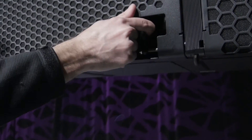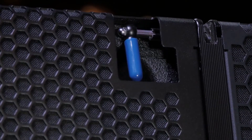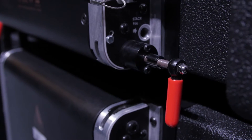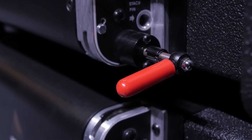Pulling the black levers will release the front rigging links. Engaging the blue lever prepares the enclosure to accept and lock the rear rigging link, as well as the E-frame. Engaging the red lever prepares the enclosure to accept and lock the rear rigging link, as well as the dolly.